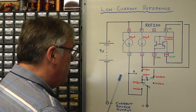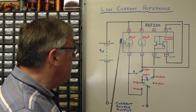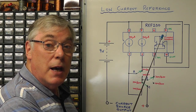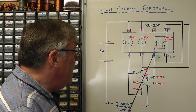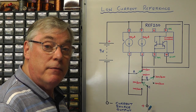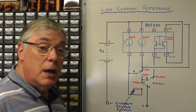To select 400 microamps, we change switch A up again. Now we've paralleled both 100 microamp sources together once more, and this time they also feed the input of the current mirror. The current mirror mirrors that 200 microamps, so you get 400 microamps out of the common pin, which comes through switch C to the output terminal. That's how we switch our current sources on the output of this project.